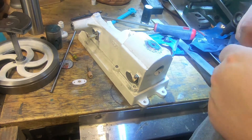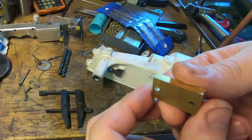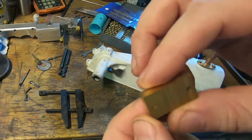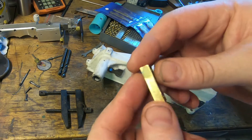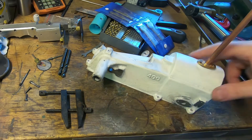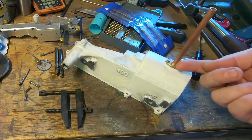That'll be the next job and we'll get in and make a couple of flanges. Cut two bits of brass, sliced them off with the slitting saw in the mill — it's the easiest way. And I've centre punched them carefully and drilled them. They're both interchangeable here; I've already made one which is what it's going to look like on the top. This needs a bend in it.